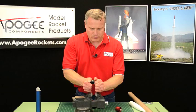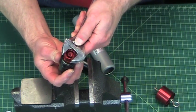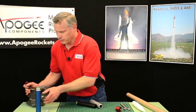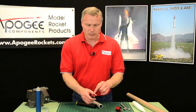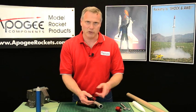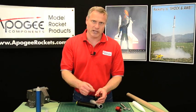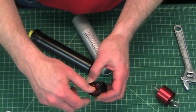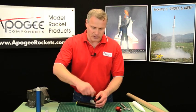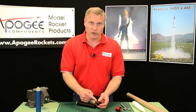You can also tighten it down with a wrench. So that's good and tight. Now if you mess up the threads on the plastic — that's the part that's going to give because it's soft compared to the aluminum — what you can do is take a little bit of thin CA glue, run it around the perimeter on the inside, kick it off and let it harden, and then re-thread this adapter to it. That works fine — that's what I've been doing all day with this one here.